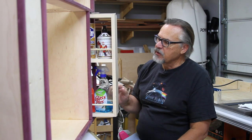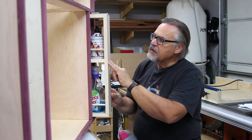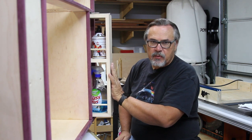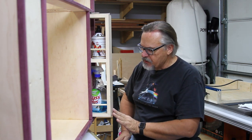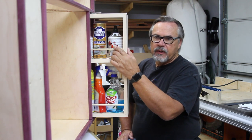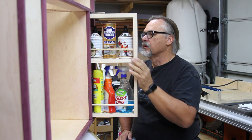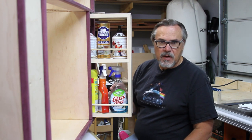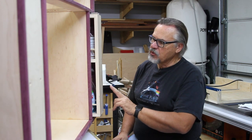These are self-closing so they automatically close when pushed. I did put some screws in on the ends — this will be covered in the back and you'll never see it until you pull the slider out, so it'll be covered by the door panel. These are just regular three-eighths inch dowels for the runners. I measured the bottom to fit most of the bottles of this type, and one drawer is the skinnier one while the other is a little bit wider so it can fit bigger objects.